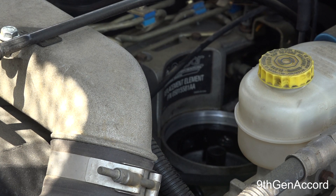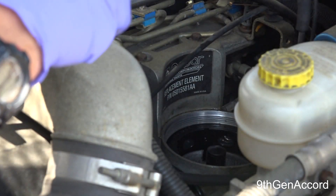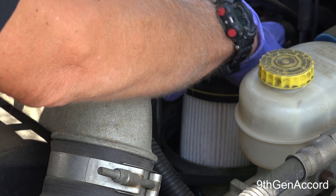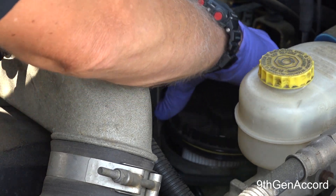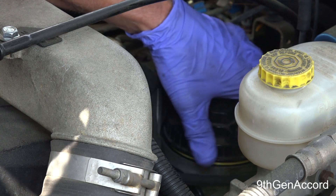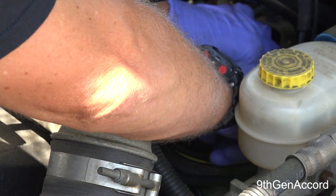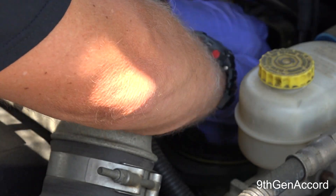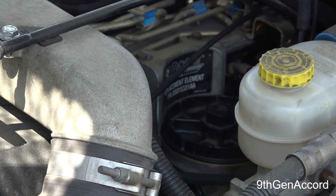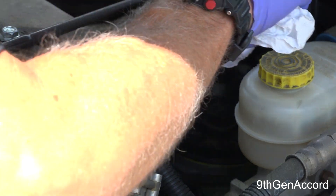Here's where people really screw up. This cap is plastic, so be careful. Put it over the shaft — there's going to be a little bit of resistance, and then it'll come down. You need to very, very lightly thread this cap on because it will go on crooked so quickly. Every single time I've tried to put this on, the O-ring makes it difficult to thread. Once it's seated properly you should be able to screw it down about three turns by hand.